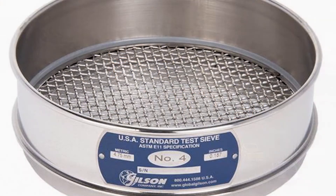The soil to be used in the compaction test is that fraction of the soil that passes the number 4 sieve, or the fraction that is smaller than 4.75 millimeters.